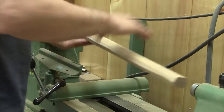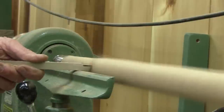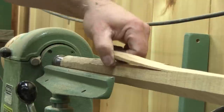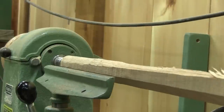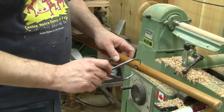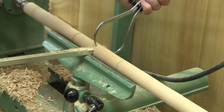So I installed this on the lathe and you may see that it's far from being remotely round. Then I turned that round. But I think I was a bit too aggressive. This won't matter in the end because the piece is bigger than what I need. When I have a uniform cylinder, I use the old rung to take some measurements and transfer the placement of the critical measurements on my piece. Then I turn it to the right size.